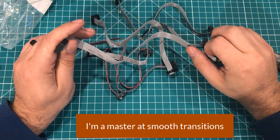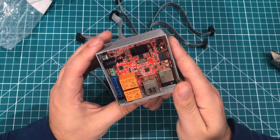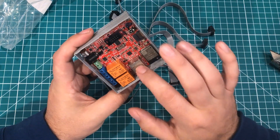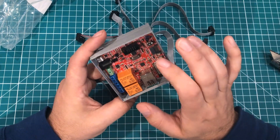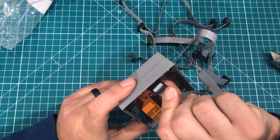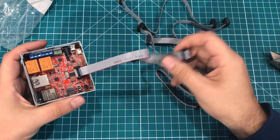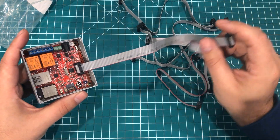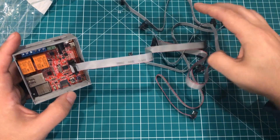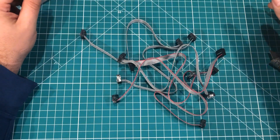These are for a project I'm not ready to talk about right now, but they do interface — I believe — with this Olimex board. This is one of my favorite ESP32 boards of all time. There's another version I've been using a lot that has PoE (Power over Ethernet). This one is ESP32 with Ethernet, two relays, CAN bus, power in, battery management, infrared in and out — all that kind of stuff. They have this connector on here that can be used for hooking up things like screens. I want to build my own interfaces, and I do have crimpers and ribbon cable. But in the event that I need bulk of these — they're like six for seven dollars — it's not even really worth crimping them at that price. So I wanted to buy a couple of pre-made ones to make sure I'm on the same page about which pin is which, and then if I need to, I can order them in bulk or make custom ones.